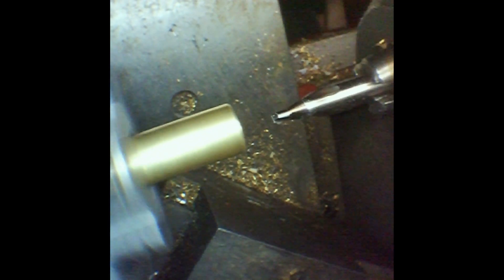Spotting and drilling for the various other parts that need to go in there. Putting this piece in our lathe, I discovered that if I tried to hold the part with the four flat spots in the lathe — which has three fingers on its chuck — it loses center and you can't find center again. So I learned to drill these holes first on the lathe before taking it over to the mill.